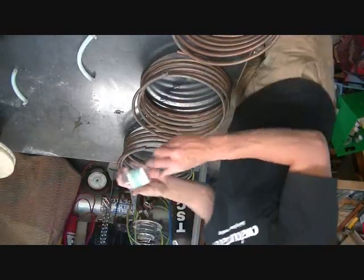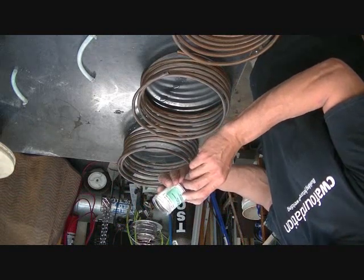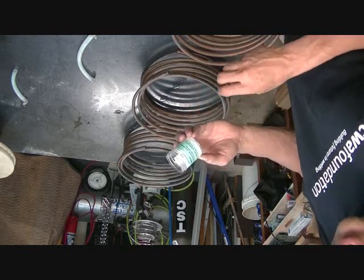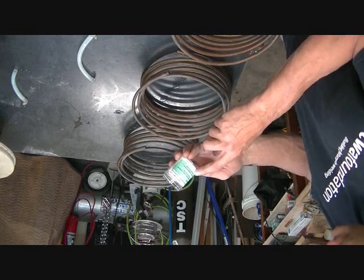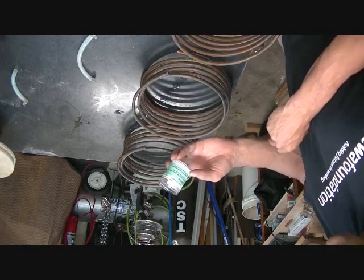And the stuff we're going to be using is silver alloy brazing kit, cadmium free, and what that means is it's going to be food quality. Cadmium's a bit of a poisoning, but it does help the joint wet out in a non-food grade environment. And then there's 45% AG, and the flux is 060, and we'll see how that works.